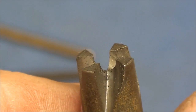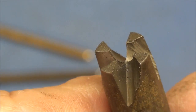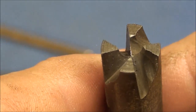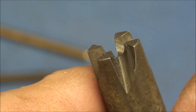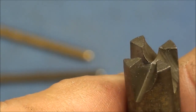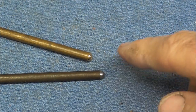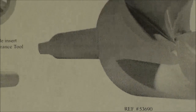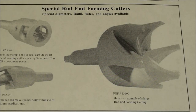The simplest method of turning a radius on the end of a shaft is to use a tool made by the Severance Company, who make very high quality tools. This is called a rod end forming cutter and you have to have the correct size for each shaft size — this is a 3/16. I bought this tool many years ago to make a little radius shaft for a project I was working on and selling, and I think I made 10,000 parts with it. The Severance Tool Company out of Saginaw, Michigan makes these from a 1/32-inch diameter rod up to 1 inch, and I believe they make special sizes on special order as well.